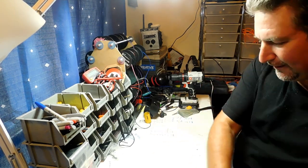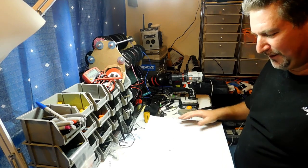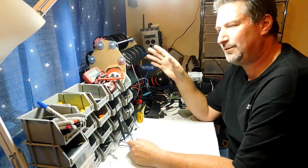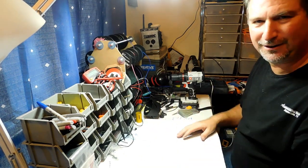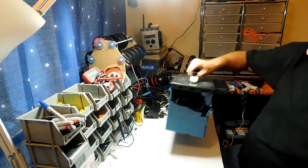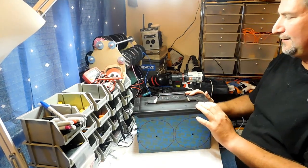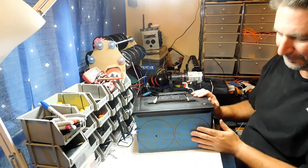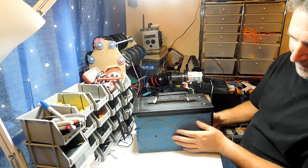One thing I like to do — even though you're working on a nice plastic table like this, sometimes you can get metal bits and shavings on here that can actually scratch your project. So I use a piece of carpet padding that I got from a carpet place down the street. I put my project on here, especially if I don't want to get it scratched. I also covered it in tape. The top is going to be painted so it's not covered, but I want to keep the bottom black. To avoid having to repaint it, I protect it with painter's tape while I'm drilling my holes.